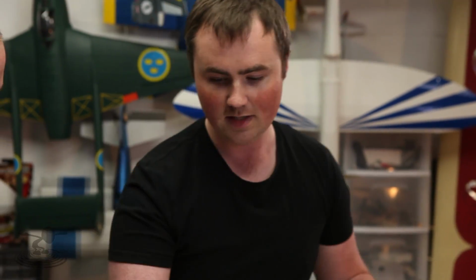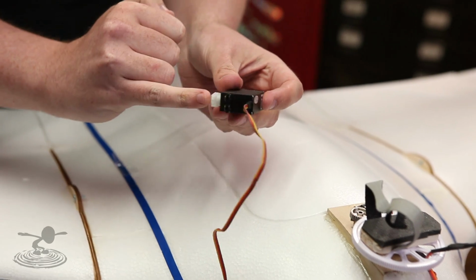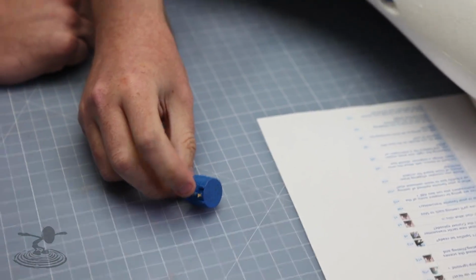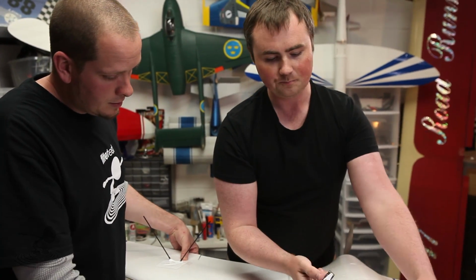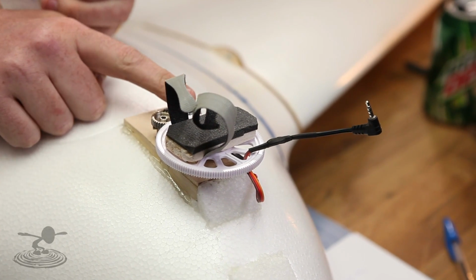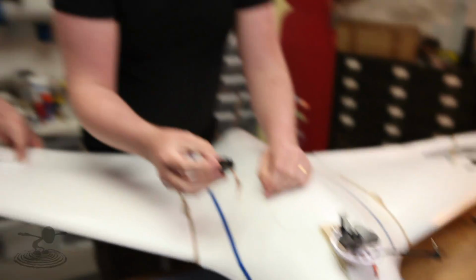Okay. And then what I did, inside of a normal servo, there's a pot always connected straight to the output. So I just took out those connectors, desoldered it and put a cable and hooked this up instead. It's just 3 wires. And then I put gears on. So this is a helicopter Flite 450 main gear, and these are 2 gears from RC cars that I drilled out and put a screw through. So that's kind of it.